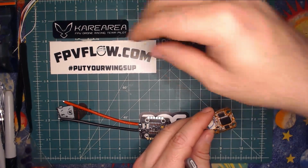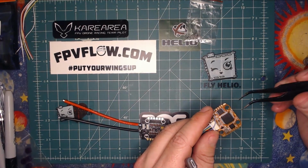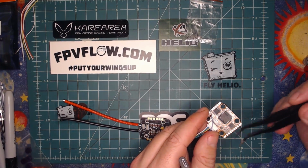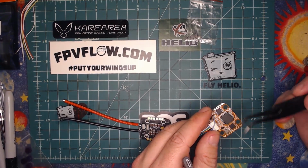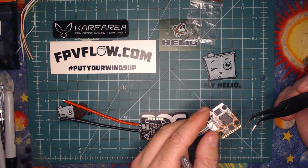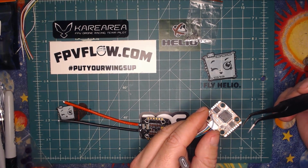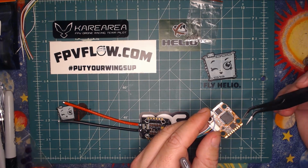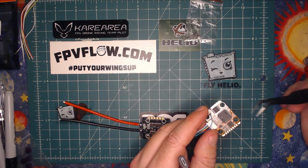Couple things. When you're going to flash, and as you're building your rig, these boards can run several different types of firmware. So you want to be aware that sometimes certain firmwares may or may not require that you have something plugged in on a certain UART. One thing to note is that the current Raceflight builds are, I believe, still looking for your transmitter to be on UART2. So if you're using FrSky, that's pretty easy. But if you're doing Crossfire, you should tag that onto UART2.